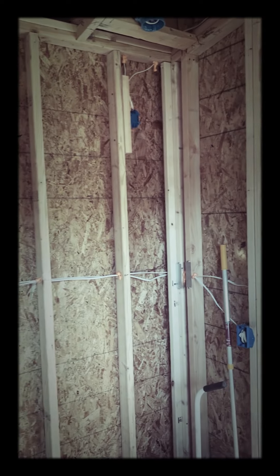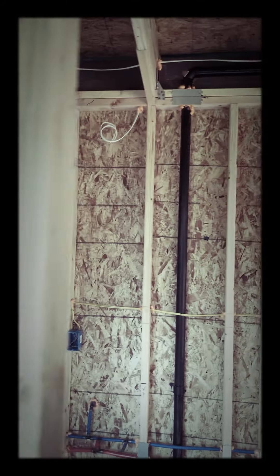Moving on through the bays, I have an outlet basically every 12 feet around the perimeter, and within six feet of each side of the door — that's code. But I've done a lot more than that. Another thing: if you have a wall section that is two feet or greater, that wall needs its own outlet — which is why this little one right here exists. It seems kind of impractical for such a small section, but code says walls two feet or greater need an outlet.